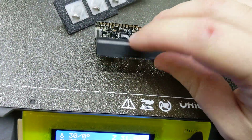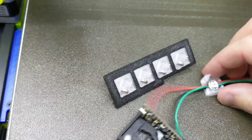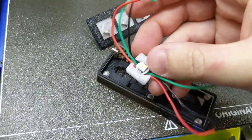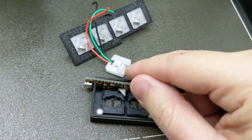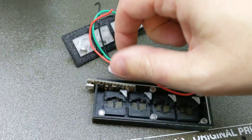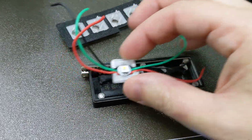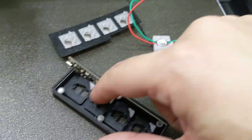This is transparent filament. Let me get one of these WS2812B LEDs — it's going to sit in there just like that, each one of them. On this one I've rotated it slightly; one of the features of my parametric SCAD is you can rotate the direction of the LED wires. So I rotated it slightly so they'll sit between each other like that.